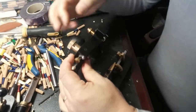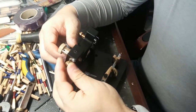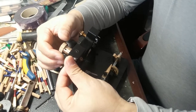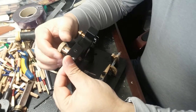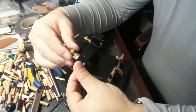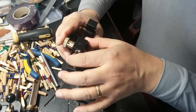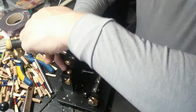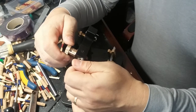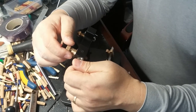After you lay down the back of the template, you have to use this lock here. You release this lock, then turn this one anticlockwise — anticlockwise to plus — just a little, to make it slightly thicker. Otherwise I'm worried the blades are going to touch the plug. So: clockwise is thinner, anticlockwise is making it thicker.